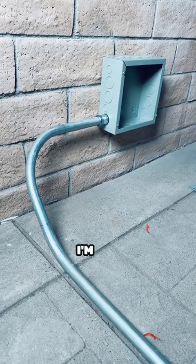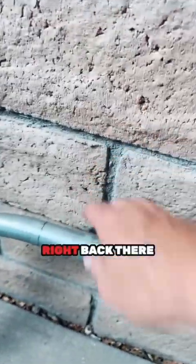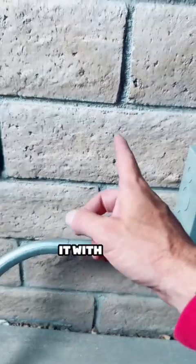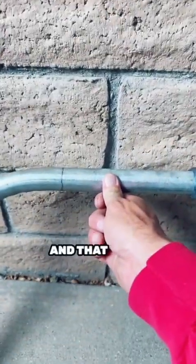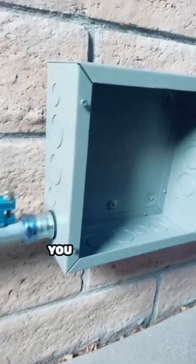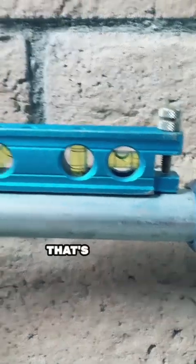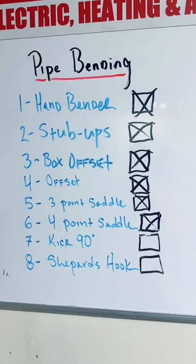Landed and branded — came out clean. I'm not strapping it here, but what I would do is put a piece of unistrut right back there. A piece of shallow strut would fit perfect, and then I'd strap it with one inch unistrut straps — that thing would be solid, you could do a pull-up from it. And there it is, dead nuts. That's what you want to see.